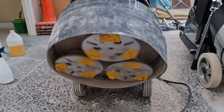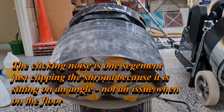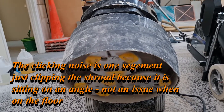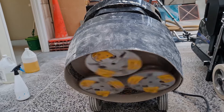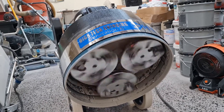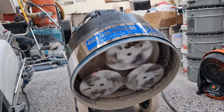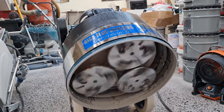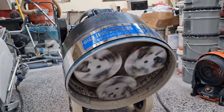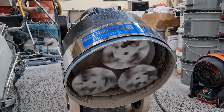Both machines are running on their slower speed here. On the old Zingy, the head does three rotations for each full rotation of the gearbox — you can see it's quite slow. On the new HTG 550, the head does nine rotations for each rotation of the gearbox, so each head spins more times before it goes around. The advantage is it cuts better and you get less resistance because you're not pulling the diamond sideways as much.